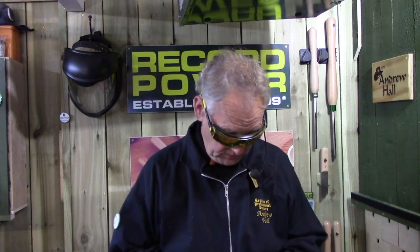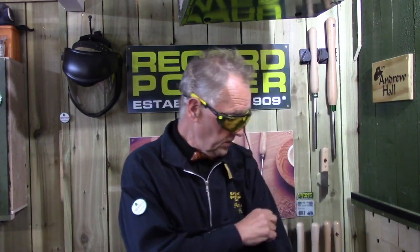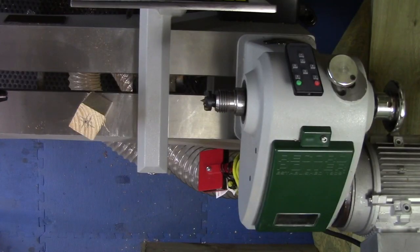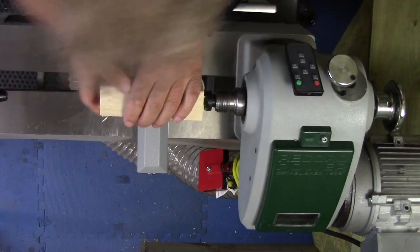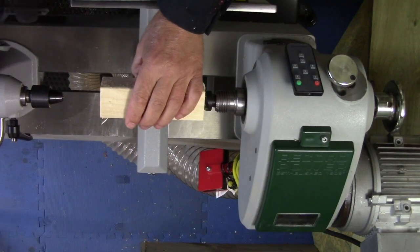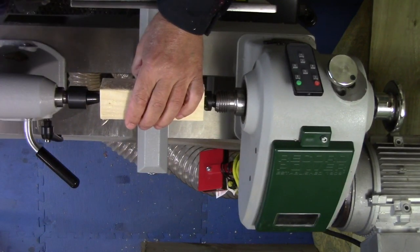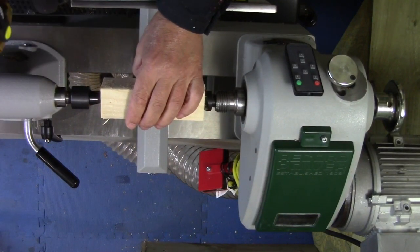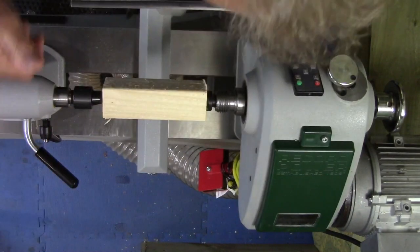This is one of my new level smocks — they have a pencil slot in the sleeve, which is handy because pencils are so easy to lose. I've also made some jig bits with a 10mm hole drilled through the center to hold pencils. I'm going to put the material between centers — just cheap pine from the builders merchants — lock off the tailstock and wind in the revolving tailstock center until it bites on, and we're ready to turn.